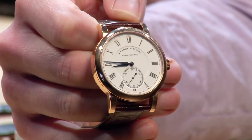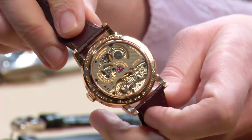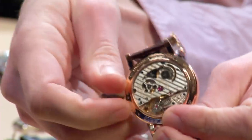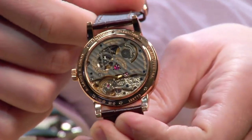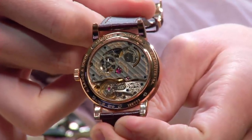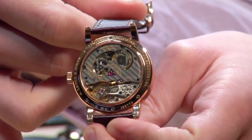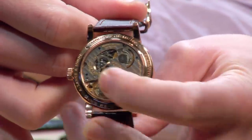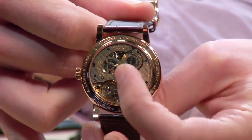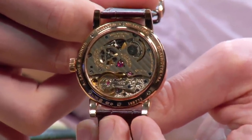The Richard Lange Pour Le Mérite was a 200-piece limited edition built around the enamel dial and a fusee movement. This is the caliber L0441. The key thing is the fusee and chain combination — this movement has 915 parts, of which 636 are the fusee chain. The chain is 15 centimeters long, can hold a two-kilogram mass, and is one quarter of a millimeter. You can see through the skeletonized three-quarter bridge the transition from the barrel to the fusee — the idea being to create a constant force mechanism.